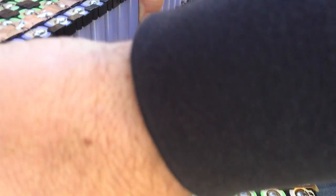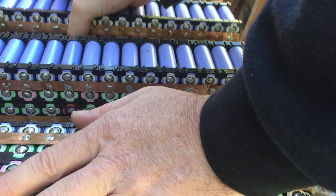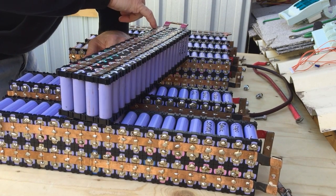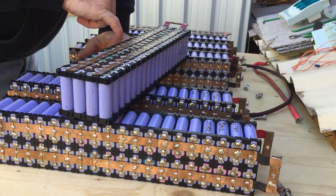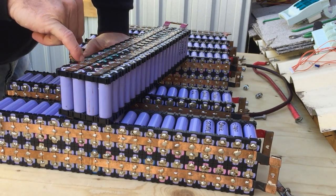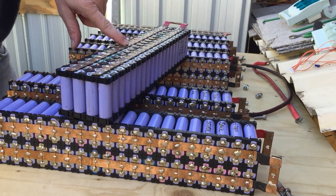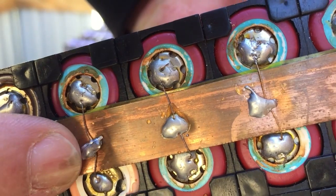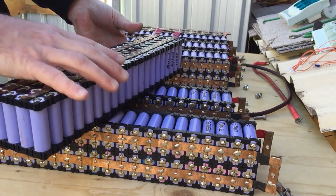The positive side on that one is fine, nothing damaged. Similarly the negative is fine on bank three. No blown fuses on bank three or bank four. Bank five is a little bit dirty with flux, but it's on the plastic of the battery, not on the steel part. There's a failure point there — a bit of solder, it's not even hooked up properly, so bank five has a poor solder joint.